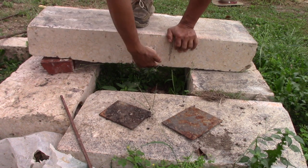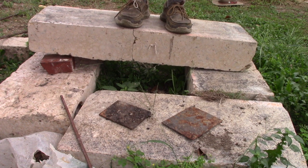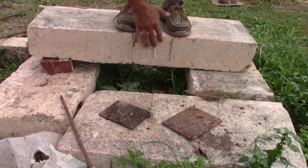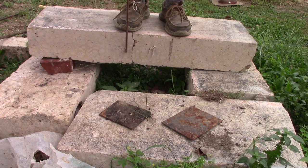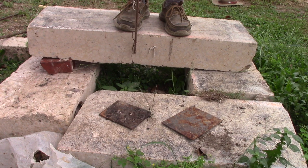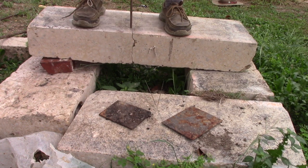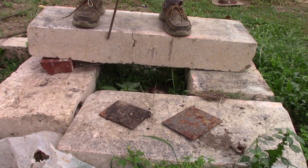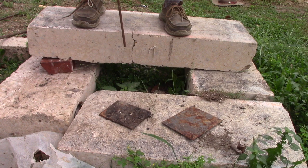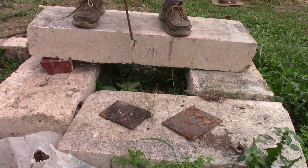So now when I load here, that's in tension. Right? So now I can load this full crack, and the bottom part is in tension. But this does not work if this is fractured like this, if it's fully fractured open, because then it changes its load capability right about here. This is fractured open here, so you still need to solid fill this crack so this performs in compression still. So this stays in compression, the top part. That's the tension side, compression side. It doesn't work if I allow this gap to remain. It will still cycle. You need to close it up.